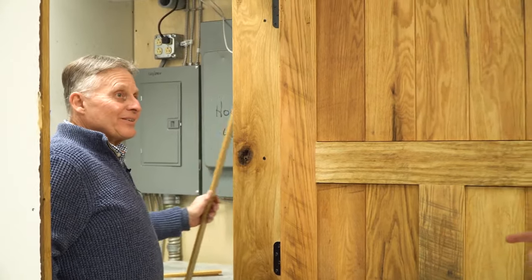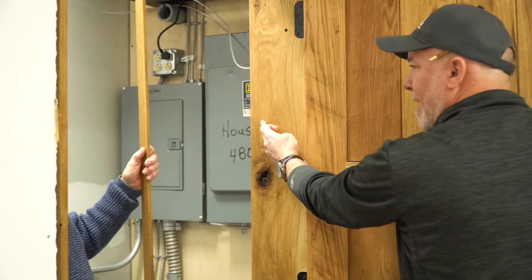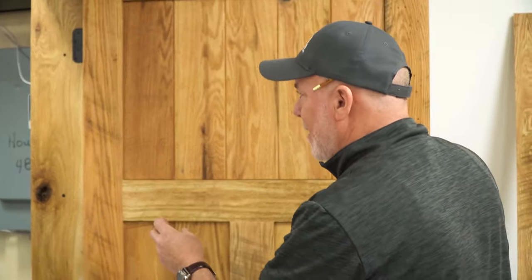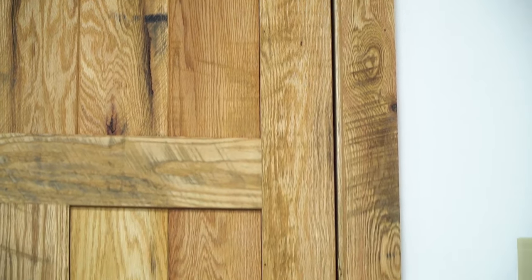Going back to the weight of this door — it's an inch and three-quarter door, and I'm looking at four-inch hinges. Those hinges are only as good as how they're fastened to the door, to the jamb, and the jamb to the wall. On heavier doors, we use ball bearing hinges, which makes the door work a lot smoother. You want to make sure you get a good quality hinge when hanging these doors because of the weight — you want it to not bend or twist.